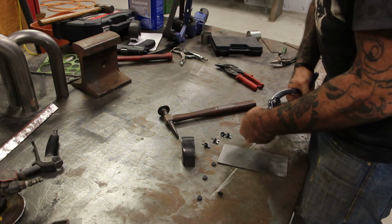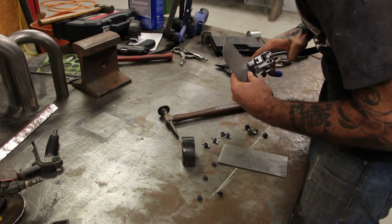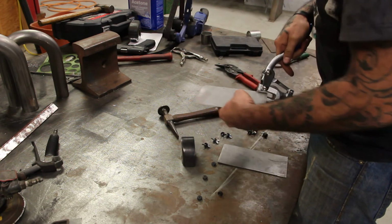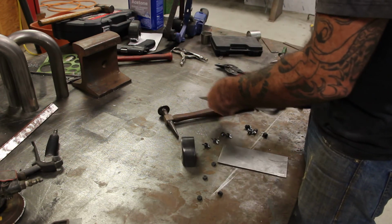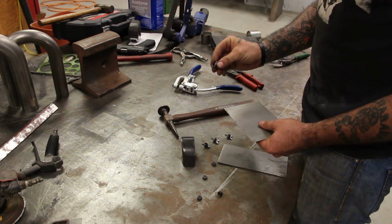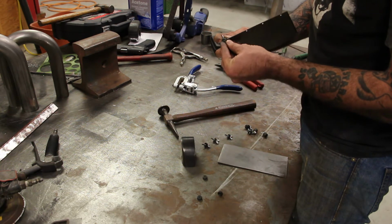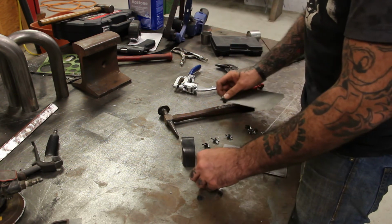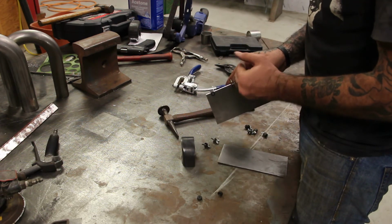But you want to punch the hole fairly close to the edge of the surface that's matching up to your secondary piece, or the edge of the patch panel, whatever you're working with. Pop a couple of holes. Not much to it. Okay, there you go. And what you do is you're going to unthread the bottom piece of the gripper, slide it right into place, your lower piece, and you want to thread it back on, but loosely. You know, just get it to where it's close. Don't actually tighten it down. Slip these in here just like this.